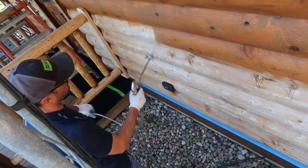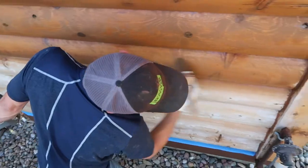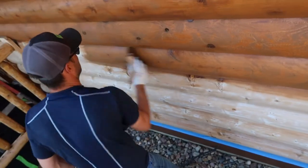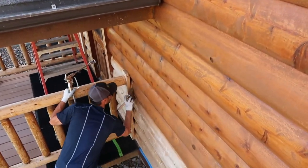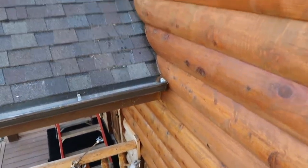So this bottom I'll go a little bit faster on that. Here I can see we've got some little light marks — not anymore. Too much is not a good thing and not enough is not a good thing, so there's that happy medium. Here as I come up to my rail, I'm going to let the brush do the work, get back inside there. Still got a lot of stain on my brush so I'll hit the next one too.